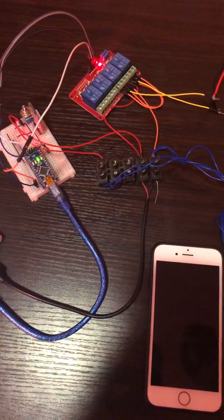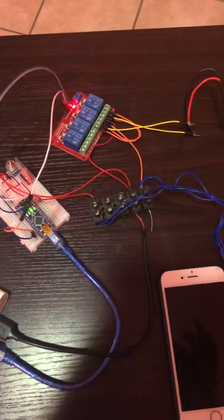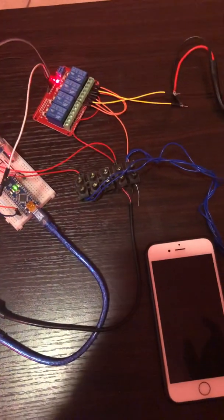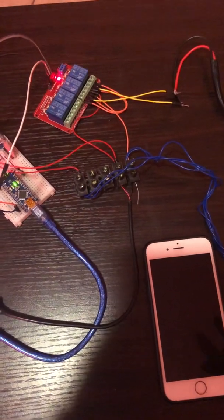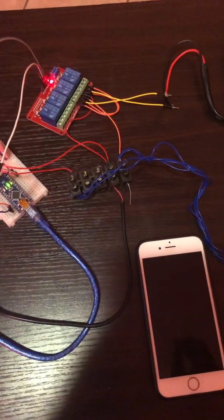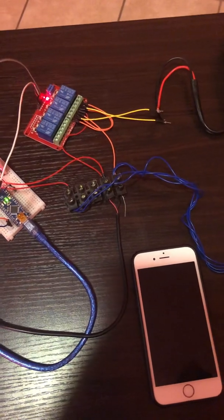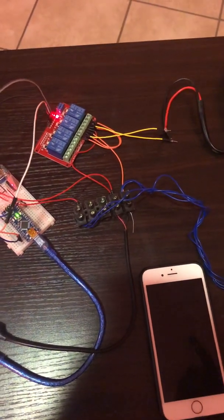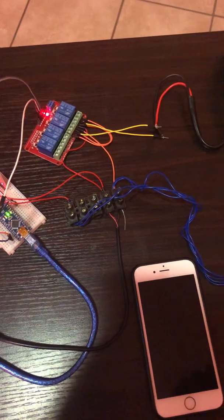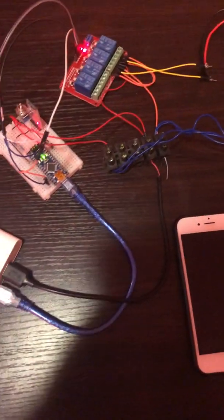So before we go into the other components, let me just say this is a transformer remote isolation device. What this means is it's basically a unit that will be used to isolate pad mounted transformers remotely. So instead of having a technician or an operator go into the pad mounted transformer, into the compartment, and open the load break switch manually using a link stick, we are going to use this system here.